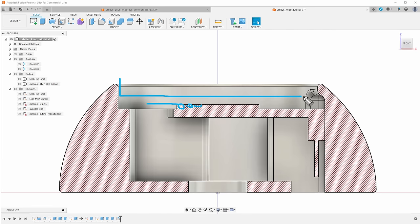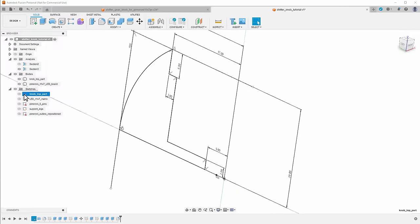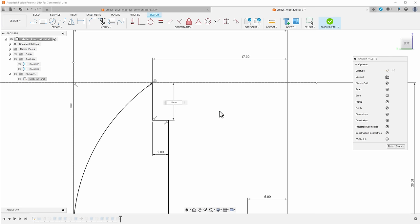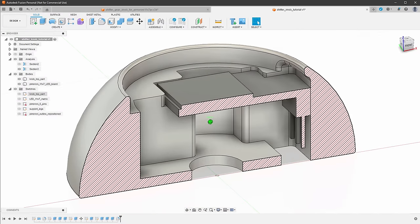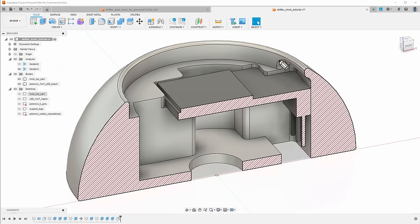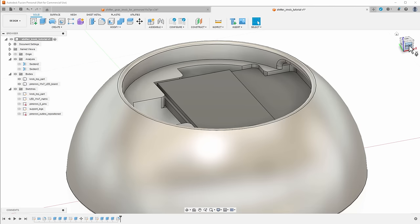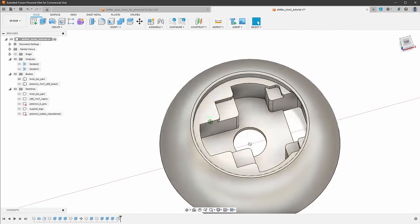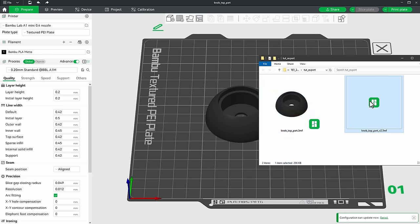Looking at the model from the front, the LEDs are sticking out slightly — so if I put an overlay on top it won't lay flat on the sides but on the LEDs, which isn't ideal. I need to increase this step a little. Going back to the first sketch — the 'top part' sketch — it's currently set to 5mm. I subtract the LED height of 0.78mm, finish the sketch, and check the result: the model looks correct, so now anything placed on top will rest on the sides. I then right-click the model, Save as Mesh in 3MF format, and open it in Bambu Lab Studio.